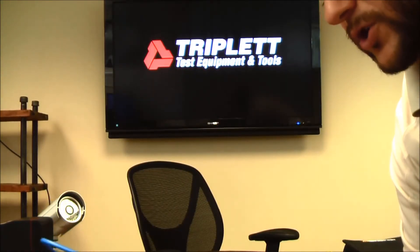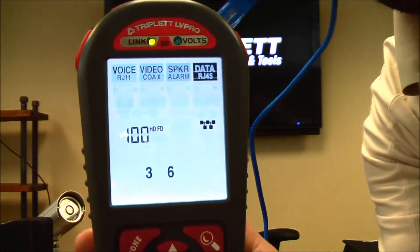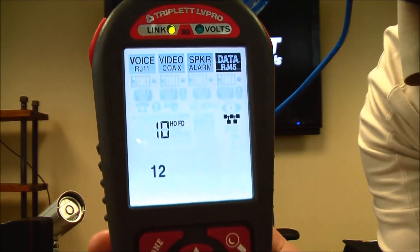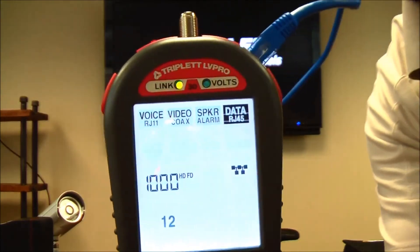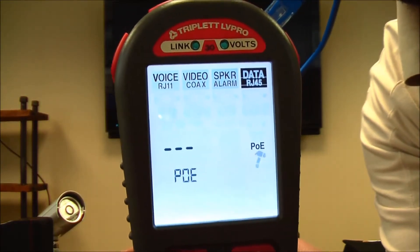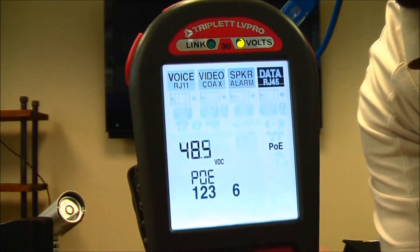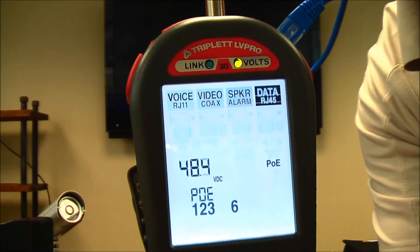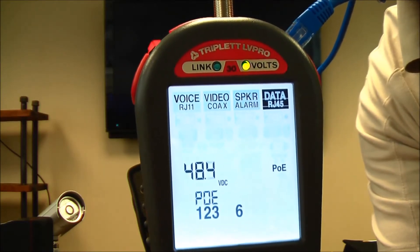While connected to the switch, there's also a network icon. I'll press OK, and it tells me all the different information about the switch: it's a 10/100/1000 switch, information is coming on pairs 3, 6, 1, 2, and it's half and full duplex. The activity lights at the top confirm there's a link. There's also a PoE test — pressing OK measures the PoE voltage coming across, and I can see it's running at 48.4 volts. This lets you live-monitor power to diagnose camera issues connected to that switch.